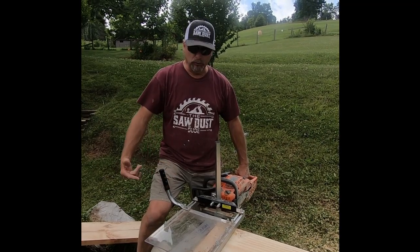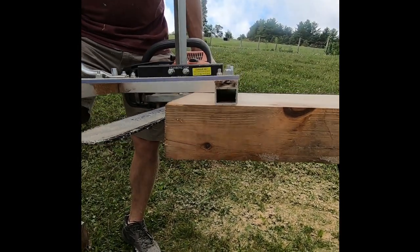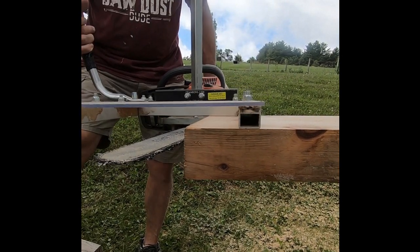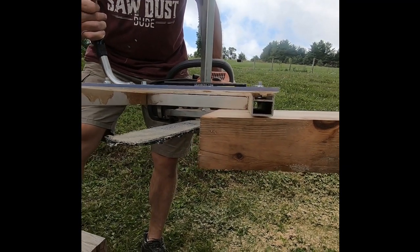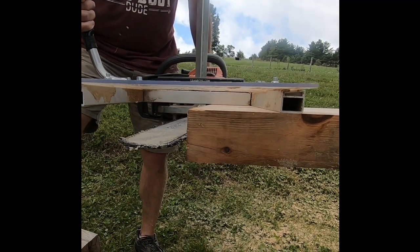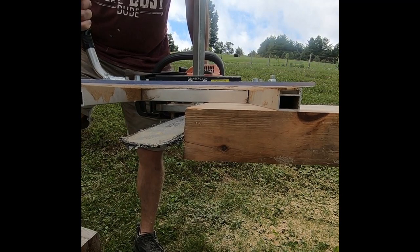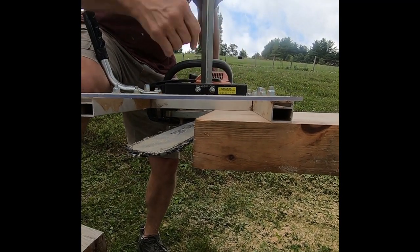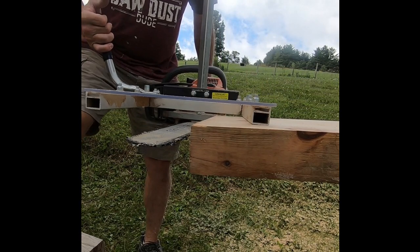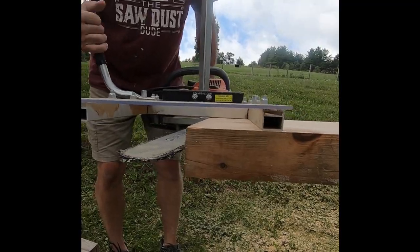Getting your chainsaw on, and you want to make your starting cut, you really need to focus on this bar right here. So there's really, you kind of got left or right like this. You want to make sure that it's flat, and also from front to back this way, so you can kind of get a feel before you actually cut your chainsaw on. Get a feel for what flat feels like, and then just kind of start the butt end of your blade, and then rock it forward. And a lot of times when I'm cutting, I'll roll it forward and then let the back end of the chainsaw catch up. So when I first start cutting, I want to focus on here, so when I make my plunge cut, then it goes from there. And then this back bar will rest on the back side of it. And then you can kind of really let the saw do the work and just go through your board like that.